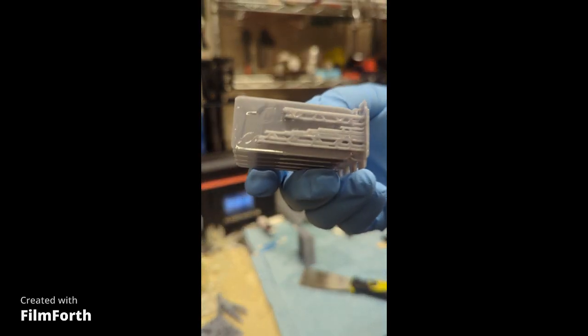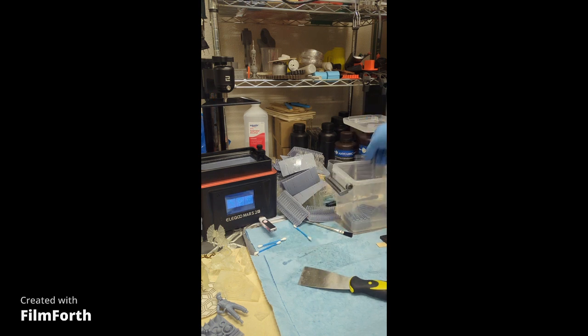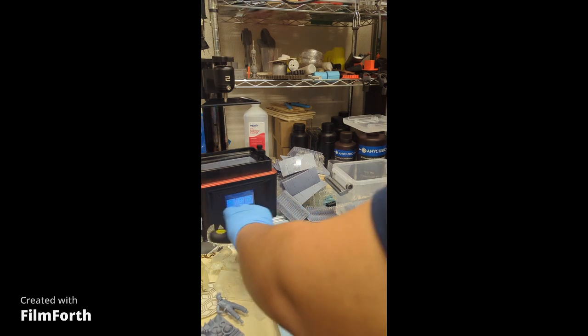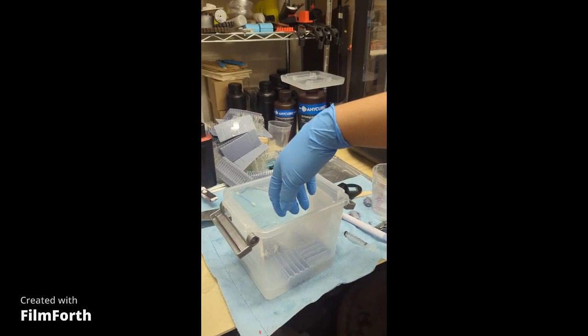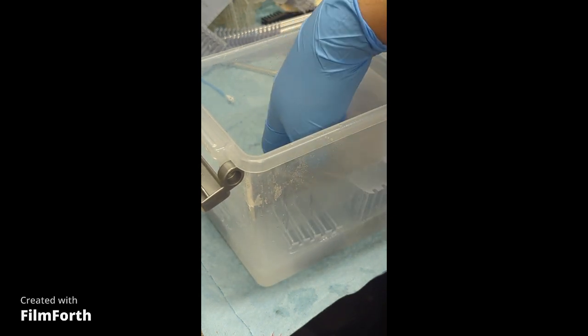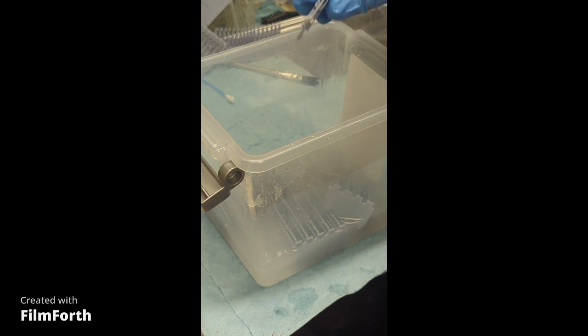I notice there's no see-through on it, so I hope the excess material is still on there and will remove once I put the alcohol in. Now I'm done with this one. Let me wipe it down because it's contaminated with resin material. I'm going in with my gloves to rapidly agitate it — you can see the alcohol turned foggy. I'll keep rinsing it over and over because this resin is very sensitive and the IPA removes all the porosity and excess material.